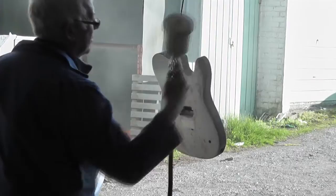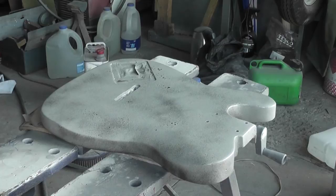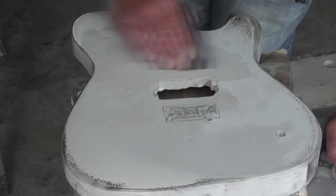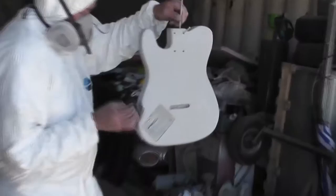We then added another coat of primer to see if there were any areas where the grain needed to be filled again — and it did. So we did the whole process a second time and then did a final coat of primer. After this had dried, we used a simple aerosol to spray on some black paint, which we used as a guide to sand the top coat of primer perfectly flat. We wet sanded using 500 grit wet and dry paper. The front came out looking extremely smooth and perfectly flat, but sadly, where we only stopped the back once instead of twice like the front, you can see that the grain will still come through on the finished product.